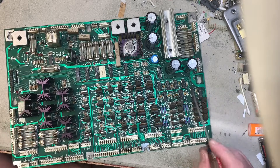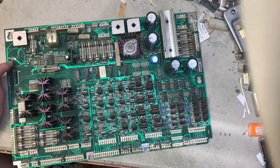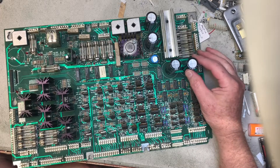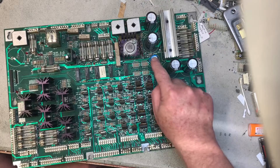First of all, they wholesale changed out all the 15,000 microfarad caps. This one over here — all the through-holes are torn, so I have to go back and do a solder stitch or wire stitch on C30, and I'm going to have to take all those off and replace them. These are the wrong form factor caps — these gigantic things. You can see how they wiggle; this is a terrible connection.